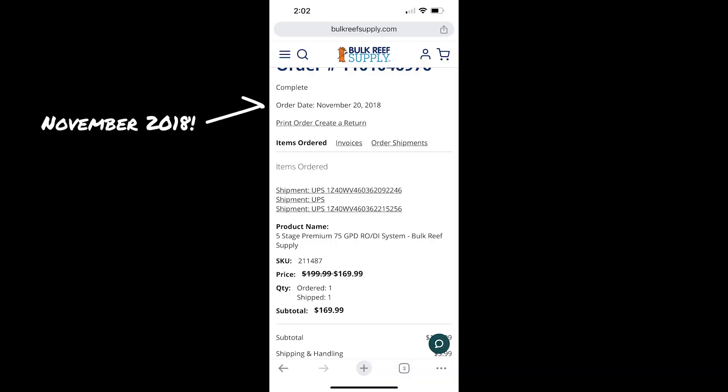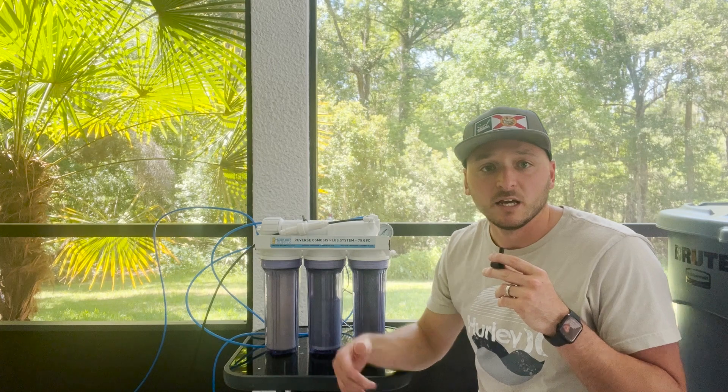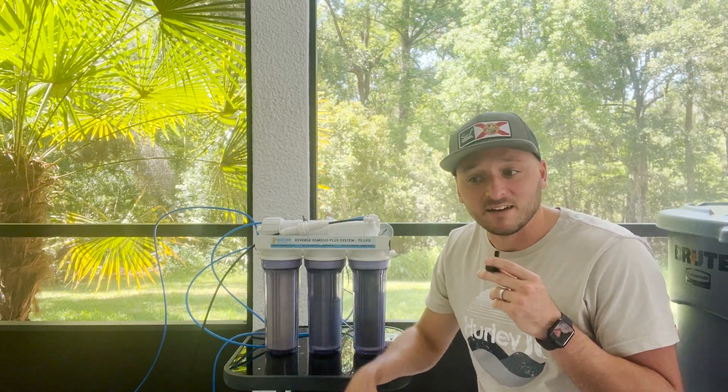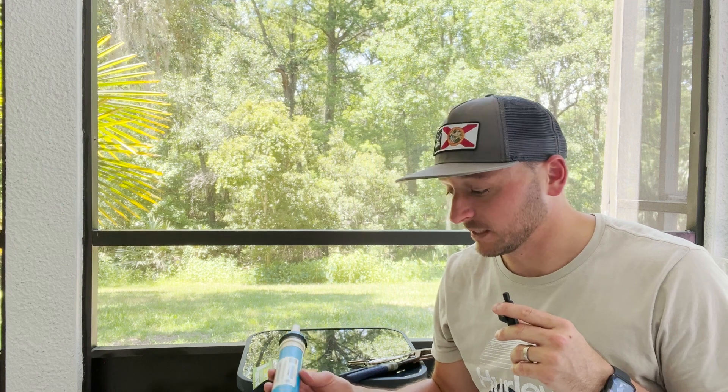So we're going to take 284 divided by the original 293 times 100, which gives us a 96.9% rejection rate - which is pretty crazy. I've never replaced that membrane; it's original, I think six or so years old, and still working perfectly. I was not expecting that. And then when it comes to the Rain Soft system, it was coming in at 276, coming out after the membrane at six - 276 minus six is 270, 270 divided by 276 times 100 is 97.8% rejection rate. Shout out to Dow, you make a great membrane. I never did this experiment back in Indianapolis, so maybe the source water was great there and had a huge effect. Just totally was not expecting those numbers.